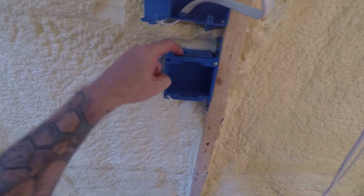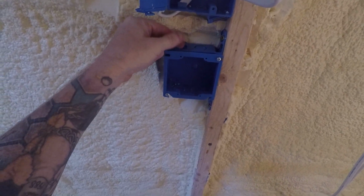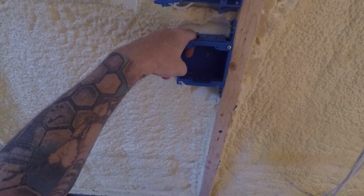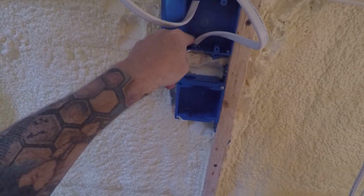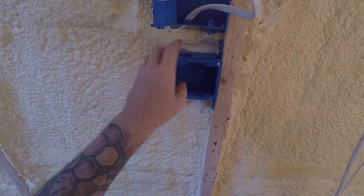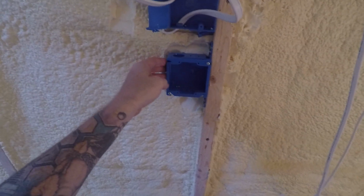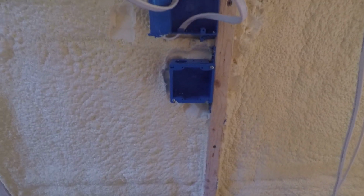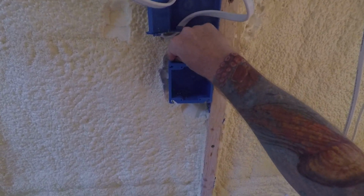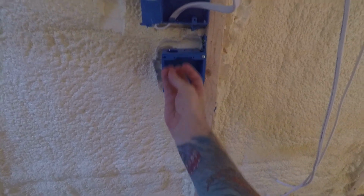There we go. Now for these guys over here, you're going to need to add the little clips that retain the cables in, because they're just holes here. Whereas these ones have built-in little clips that hold, so the wire can't get pulled out. But these ones don't have, because these are meant for the plastic conduit. But I'm not putting in plastic conduit, so I'm not buying those fittings. So you can just buy the right size ones that push in here, and they have a built-in little one-way clip that holds the cable.